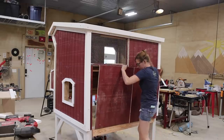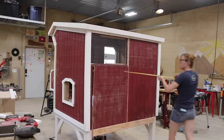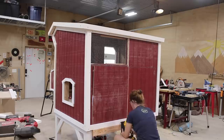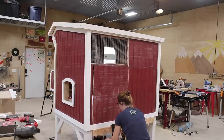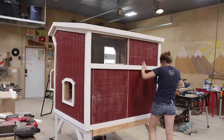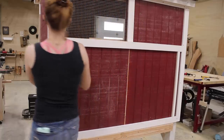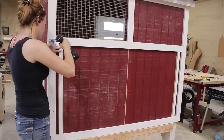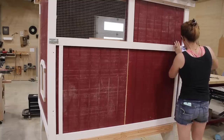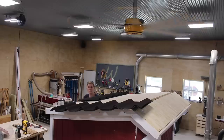Let's make that back panel now. I did the same as the front drop door — set the siding in place and placed trim on top of it, making sure part of the trim is attached to the panel and part overhangs so it catches on the surrounding siding when set into place. The last thing needed to make it functional is a few barrel bolts — I went with four, one on each corner. Another option would be to put it on a hinge and have the entire panel swing out, but I prefer the panel being completely removed when cleaning the coop.